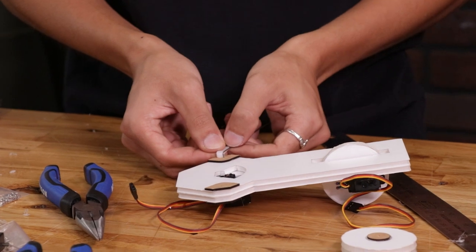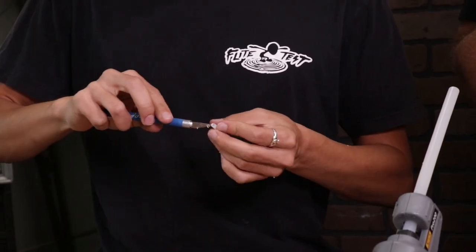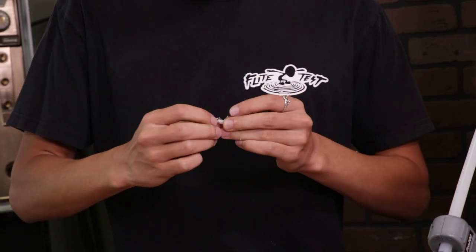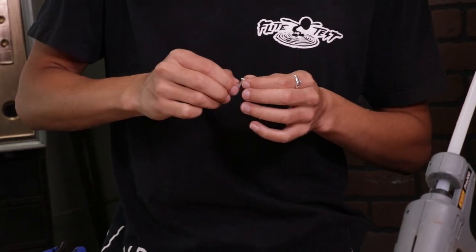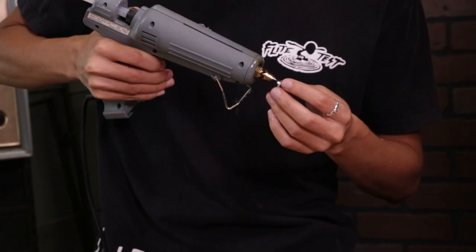I'm just gonna use the outermost hole of my servo arm, widen out the hole with a little X-Acto knife. You can also do this with a drill bit. Slide the linkage stopper through. These linkage stoppers are actually just the linkage stoppers that come with our power packs. Make sure when you're installing the linkage stopper that it's tightened enough to stay on the servo arm and enough to prevent it from wobbling too much, but you don't want it so tight that it can't rotate freely in